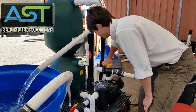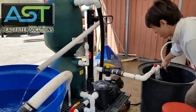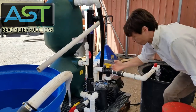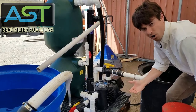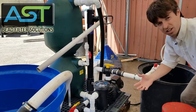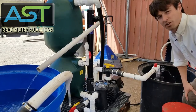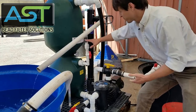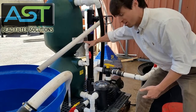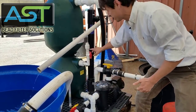I'm going to open this valve here now. If we look over here, all of our flow is now coming from the bead filter and then draining — a much more vigorous backwash, much quicker. All of the water that was inside of the bead filter and all that sludge that you've generated is now going inside of this right here. That could go down the drain wherever you need it to go. I've got a really strong vacuum right here — it's sucking air in really strong, my finger's getting stuck on there. Now that's finished, I'm going to turn my valves back to the starting position, leaving the air inlet open.